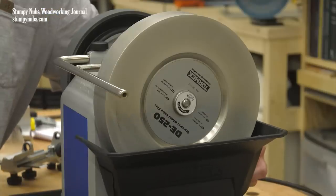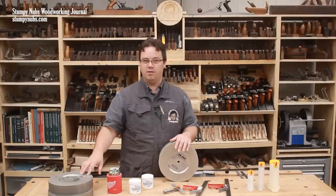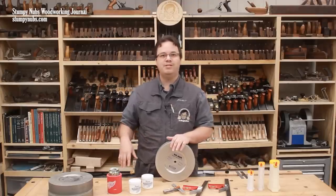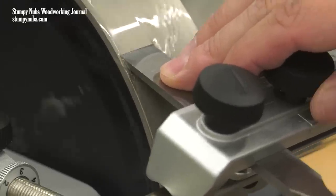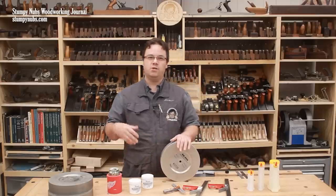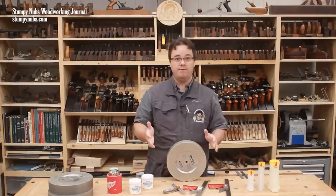They also have an extra fine 1200 grit wheel. This is not for fast steel removal — it's for tools that must always have a razor sharp edge, such as carving gouges, smoothing planes, and really nice kitchen knives. You can get a razor sharp edge with the fine wheel, but you'll have to do more stropping afterwards. The extra fine wheel reduces time spent on the stropping wheel. While it is really nice to have all three grits, you don't need to invest in all three at once — you might just add one grit to complement your regular stone wheel. The Tormek diamond wheels are not inexpensive upgrades, but if you use them properly and don't abuse them they should last many, many years — maybe even a lifetime. The grit also continues down the side of the wheel, giving you a nice large surface for flat grinding when you don't want a hollow grind. I'll link to a video below that answers some frequently asked questions, such as why coat them in diamond instead of CBN, why they're steel instead of aluminum core, and how they were developed.